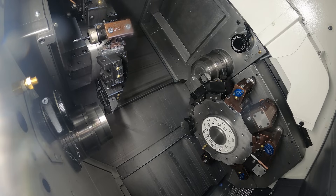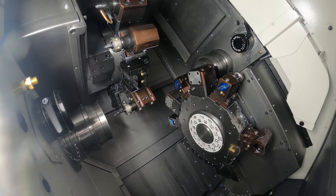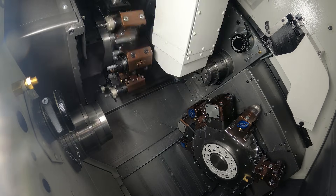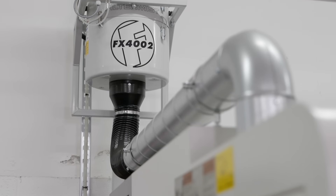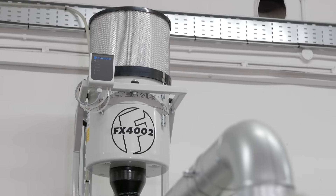With the nature of this machine — doing balanced operations with the twin turret — you can have two roughing tools in there, removing a lot of metal incredibly quickly. You're now using high pressure coolants and atomizing coolant into small particles. You honestly do not want that airborne and breathe that in. This thing just takes care of it, and aside from that it keeps health and safety happy.